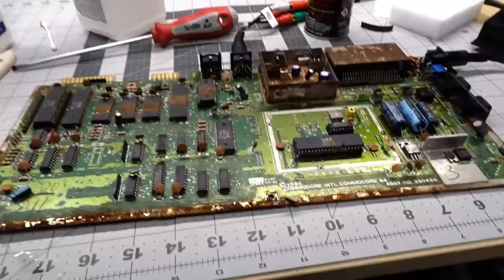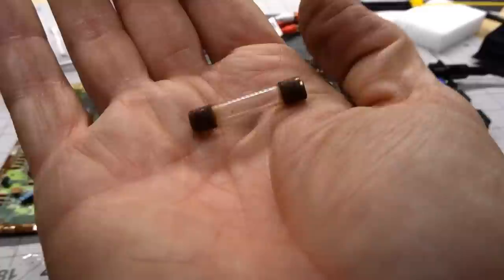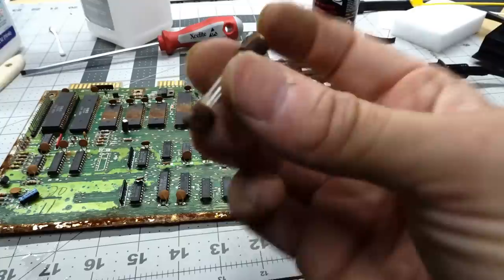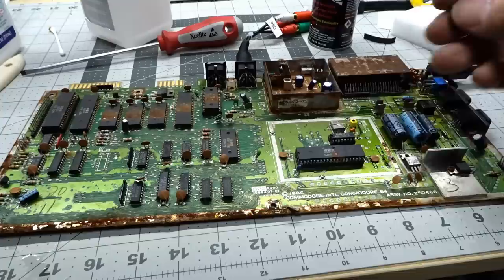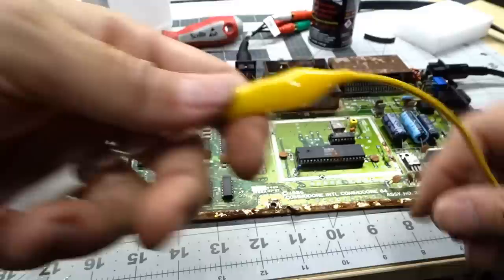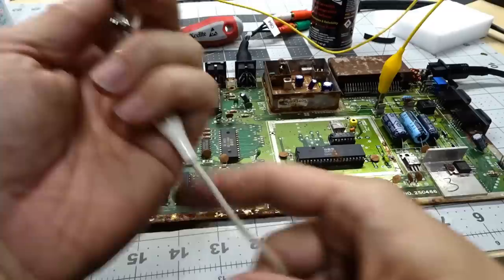Here's the board on the bench. The first problem off the bat was the fuse. As you can see, it's a rusty mess. I tested continuity with my multimeter — there was no current passing between the pins. But the fuse is actually good; it's just so rusty it can't make any contact. I removed it and found a brand new fuse, but unfortunately the socket is also really rusty. I couldn't put in the new fuse and still didn't have continuity between the two pins.